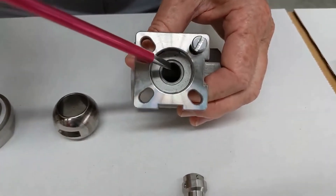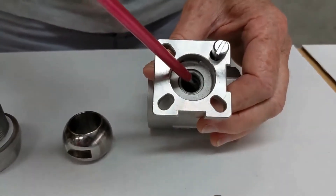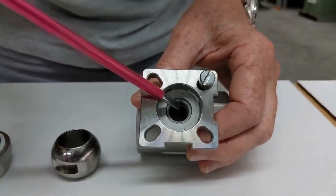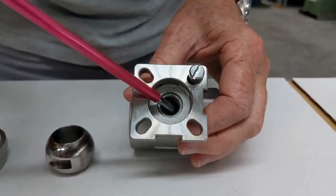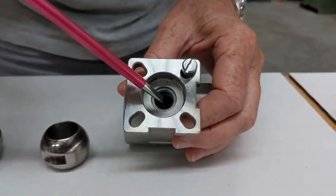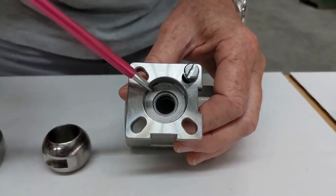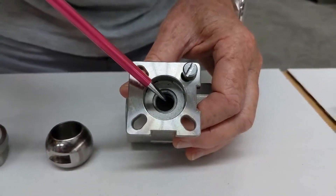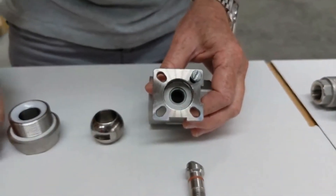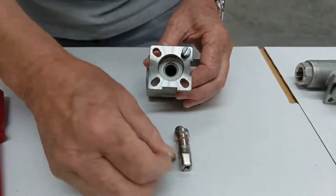Looking down the stem you'll see various seats down there. At the very base down here there's a PTFE thrust washer which is a conical unit. And there are chevron seals — four of them — and they are V-shaped, so that with actual pressure on the top, the more pressure, the more they're locked down and the more they seal against the side.